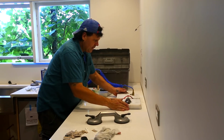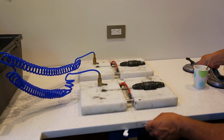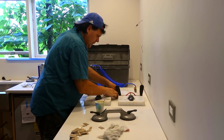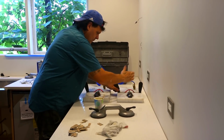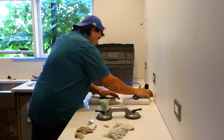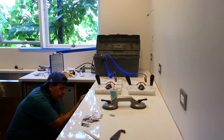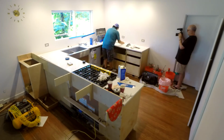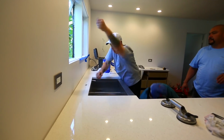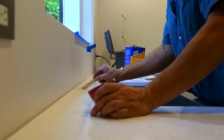When you have a long seam like this, the pieces of countertop material can actually be out of flat. And so what you can do with these is use these little cams that you can see. The little black things that are sticking up are cams that help push different sections of the countertop up and down so that you can get the seam perfectly flat for the whole length of the seam. And then that had to sit and run while that seam set up. So they did the joint behind the sink, which was much easier because it's a shorter joint.